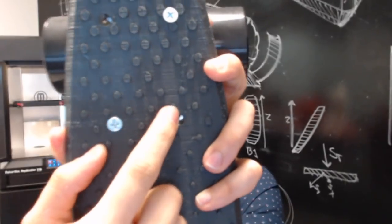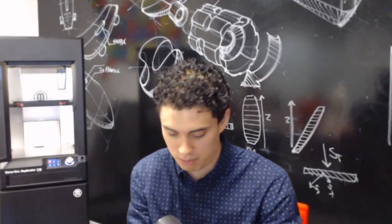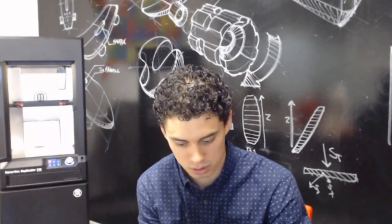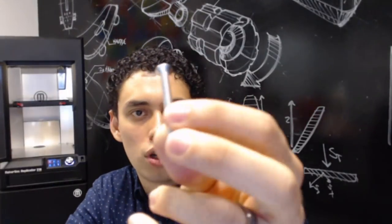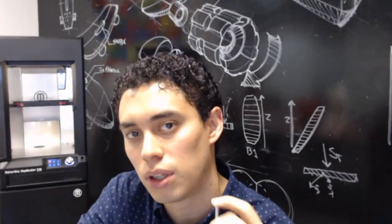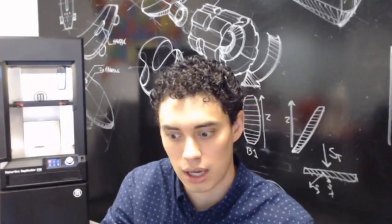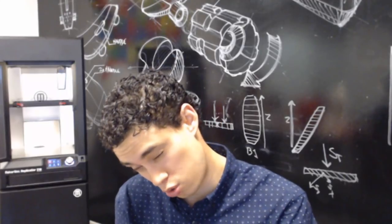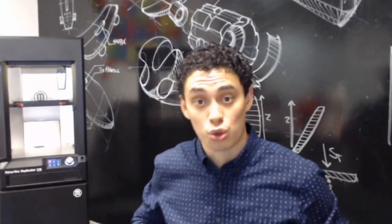the holes in CAD. However, did I add, not for this one, because of the fact that I wanted, let me take out one of these. They're not entirely tied for this one because I wasn't sure if I was going to be asked to dismantle it. But here, I'm using just these conical screws, and because I knew that it was going to be a conical screw, I wanted the screw to push itself onto the plastic. That's why I didn't add any bevels. You could if you wanted to, but the cool thing about tough, and that's why I purposely chose not to add bevels, is that it lends itself to you threading into it and tapping into it.